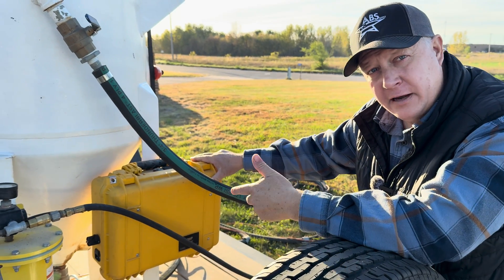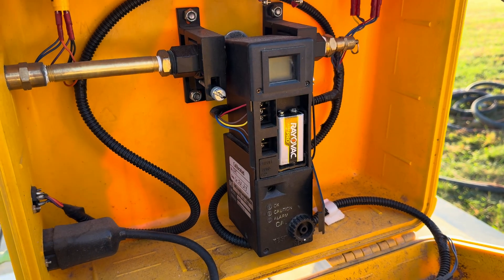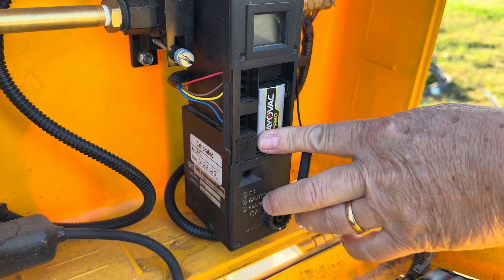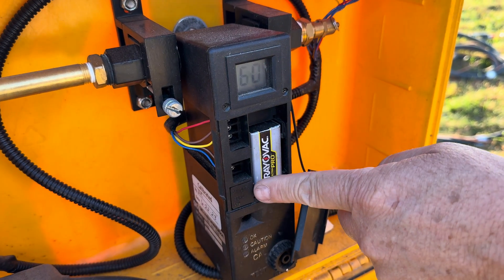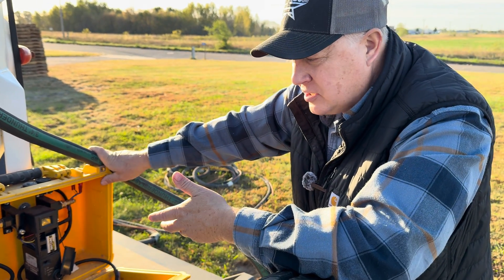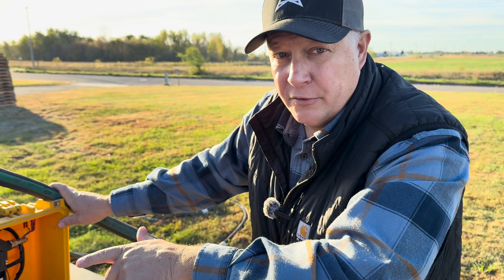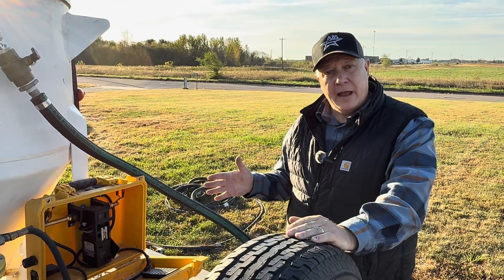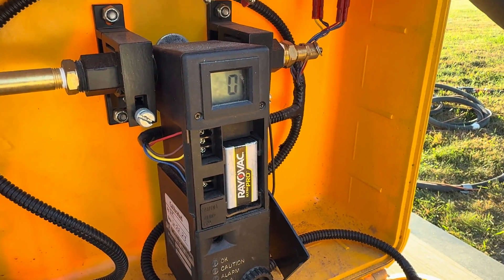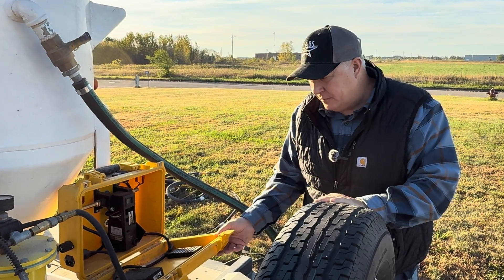I'm going to open up our CO monitor and make sure it's turned on, calibrated, and running correctly. You'll notice it is not plugged in right now — air is going through it but it is not doing anything. Let's put our battery in and turn it on. Push this button here and it's going to give us a 60-second countdown so that it can calibrate and check its systems. If everything's good it'll give us a CO reading; if not, it'll give us a code — that's where you look it up on your phone or give ABS Supply a call. After our 60-second warm-up, my digital gauge reads zero parts per million. That is perfect — we have zero carbon monoxide in our breathing air.